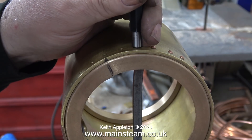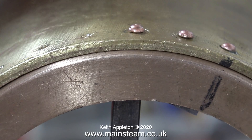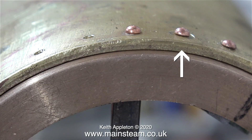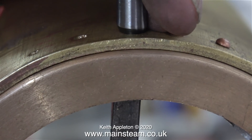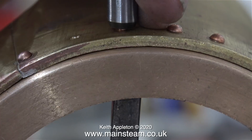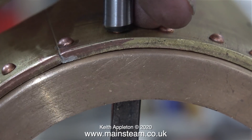Normally when I make smokeboxes I would use steel, not brass. Brass is a bit soft — it doesn't rust which is a bonus, but the rivet snap will mark the brass very easily as shown here. This was my fault — I didn't hold the rivet snap in the right position; it has to be perfectly vertical relative to the rivet. You can really see how easy it is to get the rivet snap off centre. That's really why I prefer to put the rivets in all the way around and then go around one more time, very carefully tightening up the individual rivets.